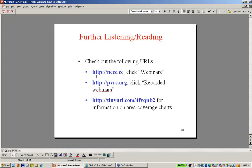Well, I would personally go with a horizontal dipole of some sort, because you're up high enough to get good low elevation angles, and unlike a vertical, it's less susceptible to electrical noise coming from the apartment or from nearby neighbors. It's usually very difficult to hear in an apartment when you're using a vertical. I think that's about it.